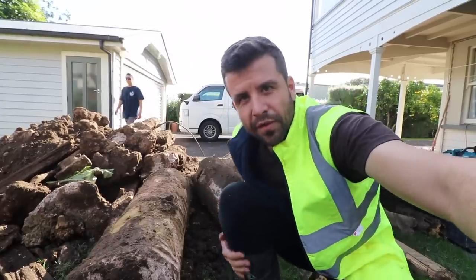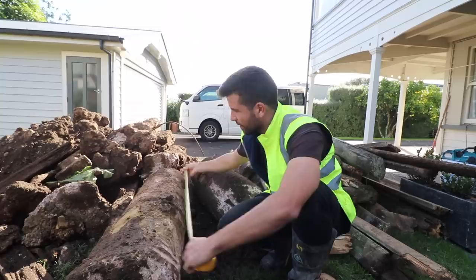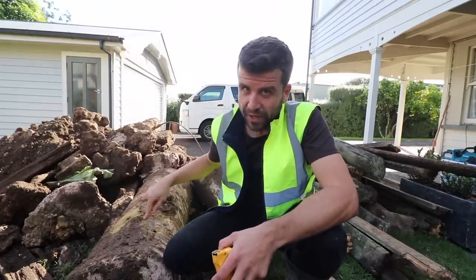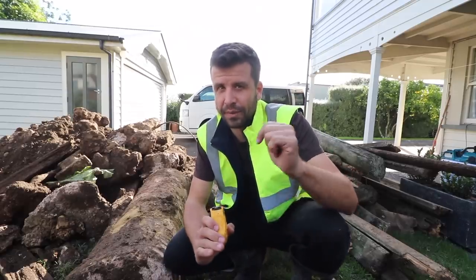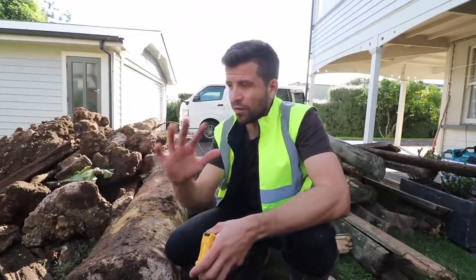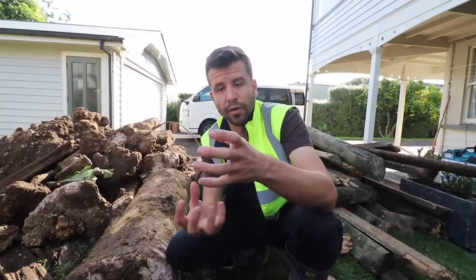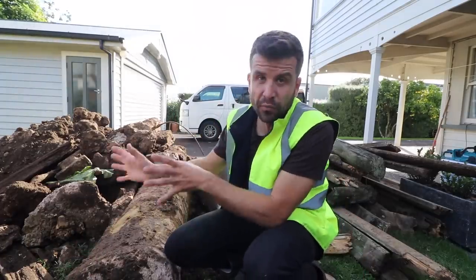So we think we know why this wall ultimately failed. This is a big block of concrete that was around the post — the post is still in there, it's 950mm long. That was the far end of the retaining wall. It is a big one, but it's not big enough. The wall from ground level up was 1.5m, but this was only 900mm in the ground. You kind of want to go in the ground as much as you go out. At 1.5m you want to go even deeper. So that was part of the problem — it wasn't deep enough. The other part was that in some cases the concrete didn't surround the post enough, with no concrete beneath the post. All that pressure goes on the post and it kind of slips through the concrete, or the bottom of the post rots out because it's exposed to dirt. So you've got all these factors in this one retaining wall that caused it to fail.